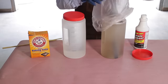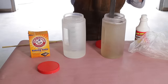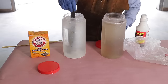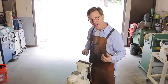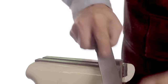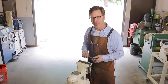It's now been over an hour. We're going to pull the file out and put it in the baking soda to neutralize the acid. Watch it bubble — this is really cool. Shall we see how well the file works now? Excellent! It cuts clean through the entire stroke, just like a sharp file is supposed to.